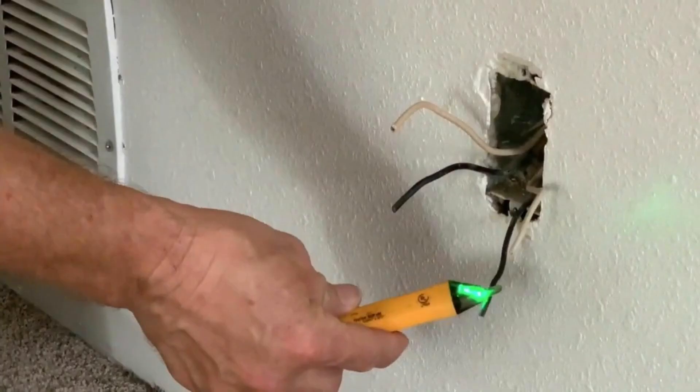Now let's install this. First, you must turn off the power at the breaker — you never want to do electrical work with the power on. Pull the receptacle out of the wall, and before you start touching things or disconnecting wires, use a non-contact voltage detector to make sure those wires are indeed dead. If you're replacing a broken GFCI, make sure you note which wire comes off the line side and which comes off the load side. I always mark the line side — the one bringing power in — with a piece of tape, so when I'm ready to install the new one I know which was the line side and which feeds the other receptacle.